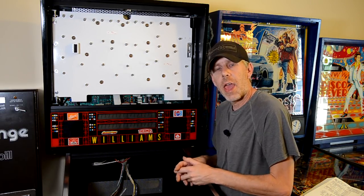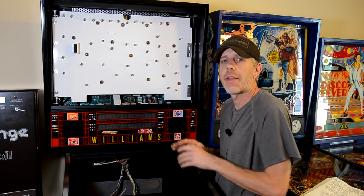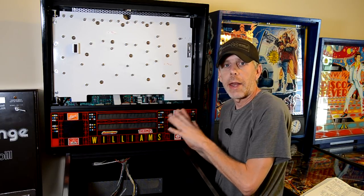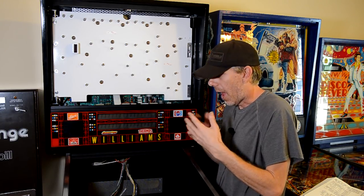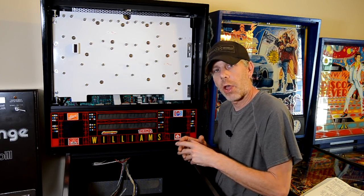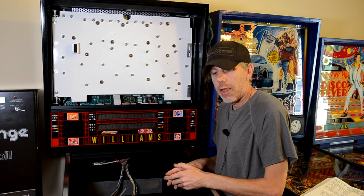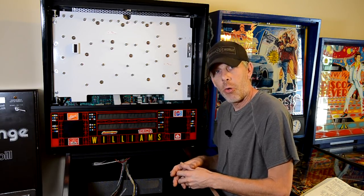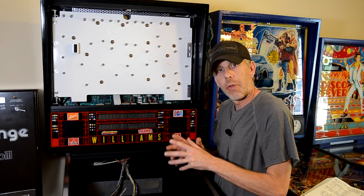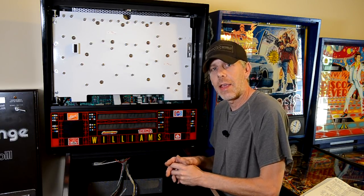So in this video, it is a fresh day and we're going to look at this with fresh eyes. We're going to go through a systematic process of powering up this machine one section at a time, checking voltages along the way, checking connectors and fuses before we even start to make sure we don't do any damage. This also applies if you just bought a System 11 game untested — you should use this procedure before you flip the power switch. So let's get started on powering up a Williams System 11C, Roller Games, for the first time.